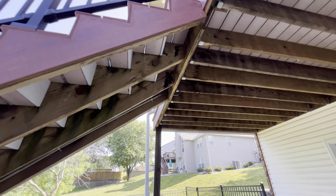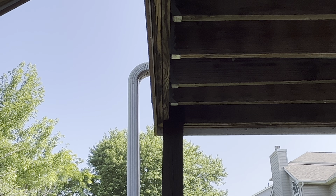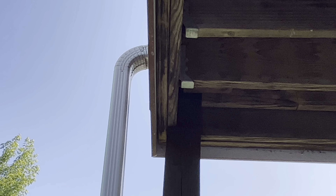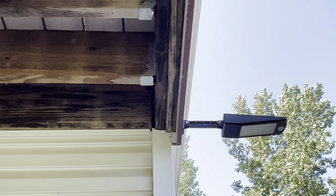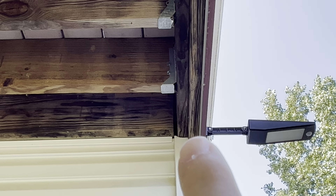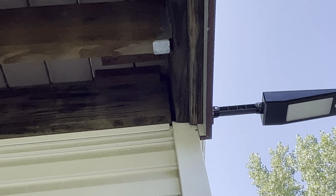So you've got this outer beam attached, resting on the support. But if you look, only one of the joists of the beam is sitting on the support — the other one's just hanging off completely. And down here, same thing: this outer joist isn't even sitting on anything, it's literally just floating in the air. You can see that there.